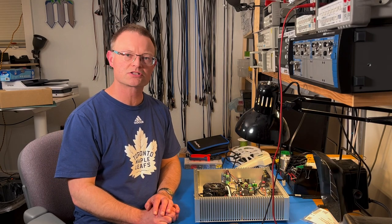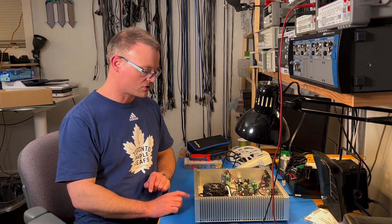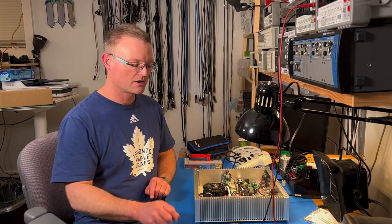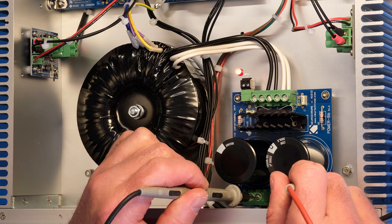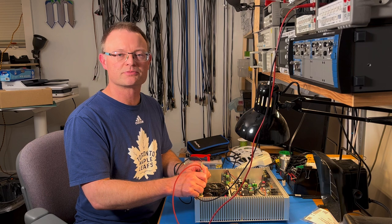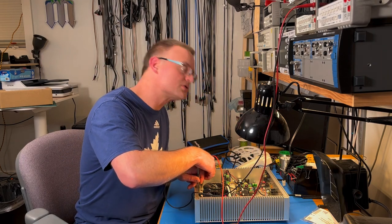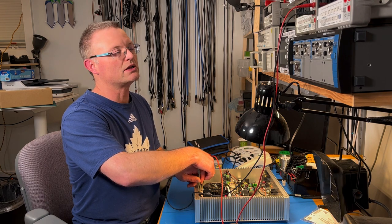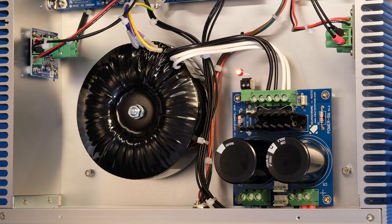As a sanity check, I remeasure the power supply with the amplifiers connected. With the power on, V-plus measures 32.2 volts and V-minus measures minus 32.28 volts. The power supply is near-perfectly symmetrical at plus/minus 32 volts. Once the amplifier starts delivering significant power to the speakers, the voltage will droop further toward plus/minus 30 volts. You'll also notice the LED extinguishes much faster when turning off with the amplifiers connected, due to the idle current of the amplifiers.